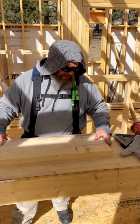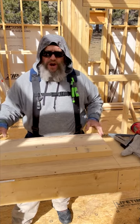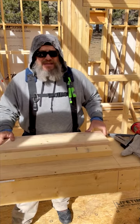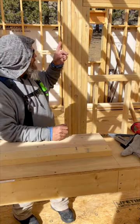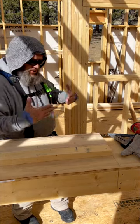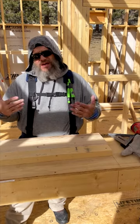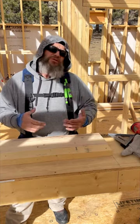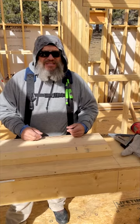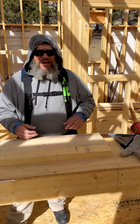Hey folks, so what am I doing? Good question. These are the scraps from my ceiling joist that fell off the side. On my top plate here in the middle, I don't have an overlap — I just have them butted. I'm kind of okay because I have a good inch and a half that I'm sitting on, but just to make sure everything stays nice and tight and secure, I'm going to go ahead and put a lap splice in there.